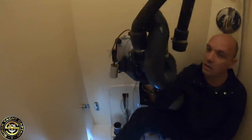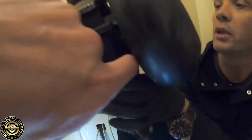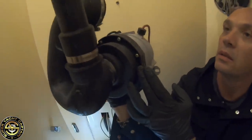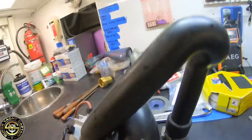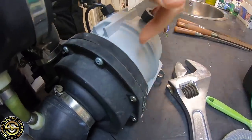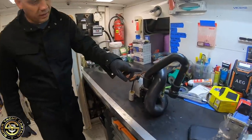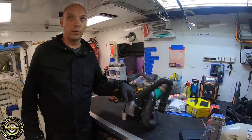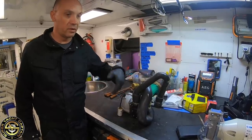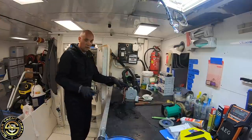That is the motor, and inside you have the macerator. This is a capacitor motor powering the macerator — the macerator is under the black cover. We're going to open all this up and take it to the workbench. Basically, when we flush the toilet, the dirty water goes through here, comes around, down into the macerator — this black piece of plastic with the screws — gets macerated and comes out this pipe into the gray and black tank. Also inside here is a non-return valve. If the non-return valve is broken, the macerator cannot work — it will accept the water but not send it out.